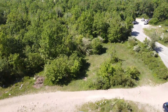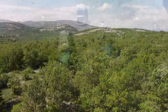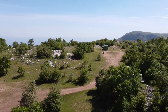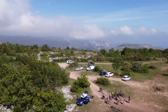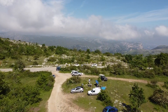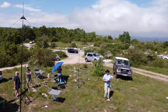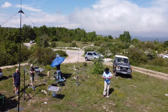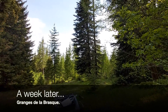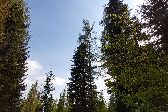The weather cleared up, so you can have a quick look around. Big surprise: the T106-2 wins hands down on 20 meters. I was expecting that, but not such a big difference. I tried to tune both UNUNs on 40 meters — it did not work. The 8-meter wire combined with the 2-meter counterpoise just didn't agree with 40 meters, so that'll be for another day. I found a pretty nice spot and I'd really like to throw a wire up that pine tree.